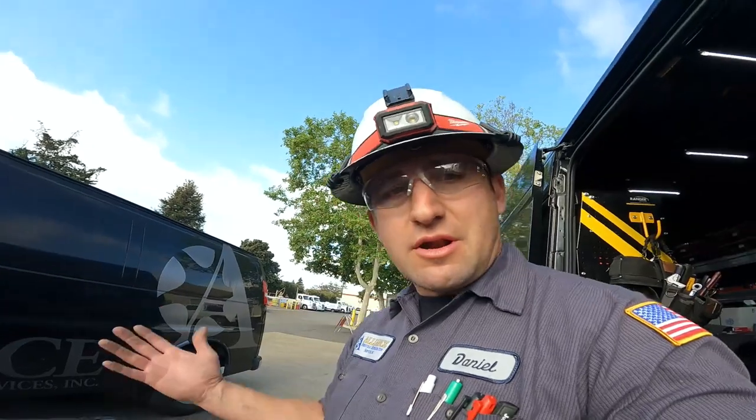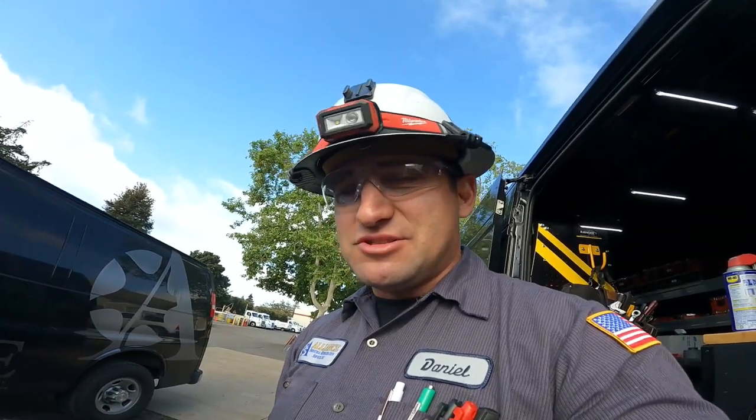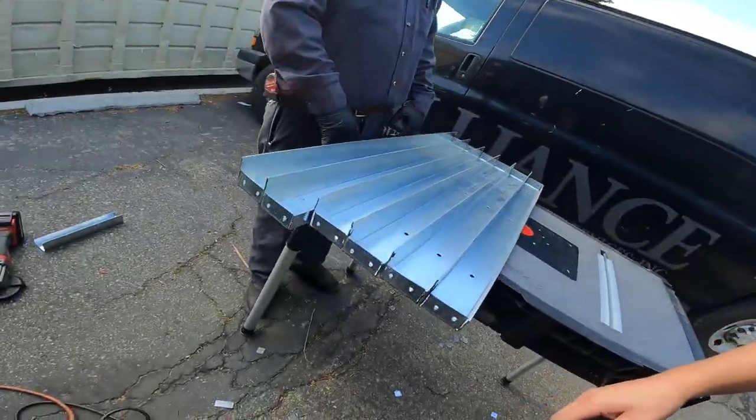All the bracing done. We're gonna put it underneath to catch the fans if they ever do decide to fall again. So this little bit of material is gonna save the customer like $30,000 in Freon. It's not that much to do. If you guys have any of these condensers, try to brace them up. Try to save your customer from spending that kind of money. I'm talking with BAC right now and seeing what they can do on their future condensers, just to try to prevent this kind of stuff from happening. So check it out.